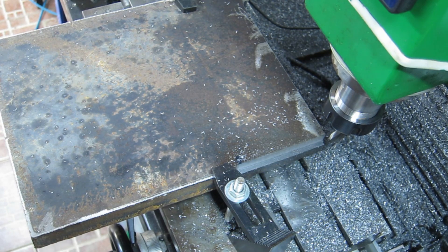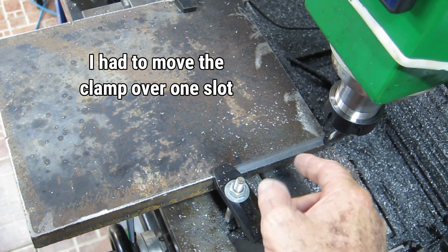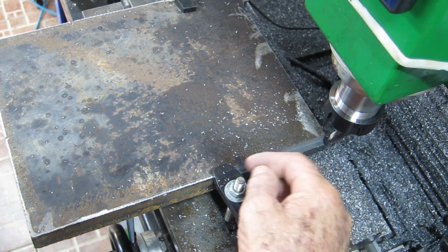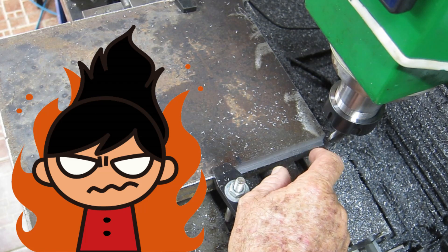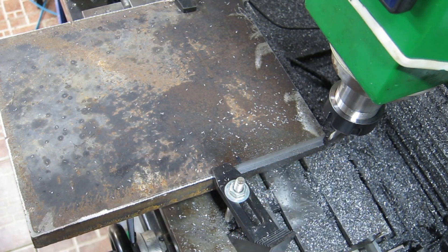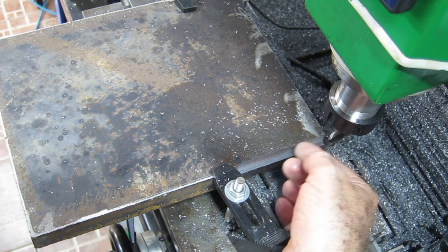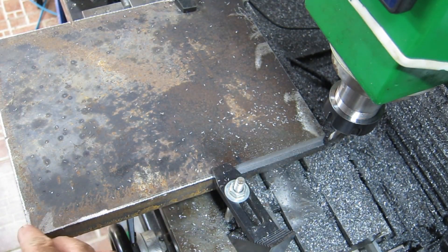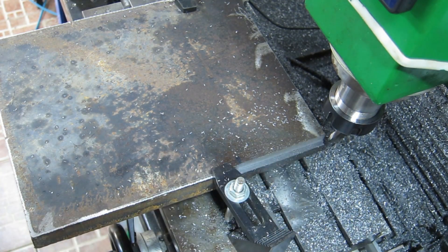I came in this morning, got the tape out, and measured how far I got up here and measured that back up there. With the 100mm travel I've got, I can actually get down to that mark and just beyond it - so the center of the cutter is just past that mark. I got halfway through before my wife had a crack at me about no-noise Sunday, so I'll finish that tomorrow morning. Then I'll run a four-flute cutter over it to smooth it up, which will give me somewhere to run a gauge along when I set it up sideways - I should be able to get all the way from this edge to finish it off. These outside edges are not particularly important - I'm just going to make this the same width as the table.